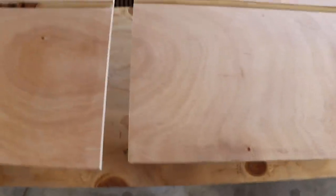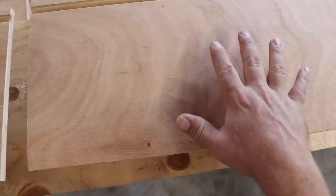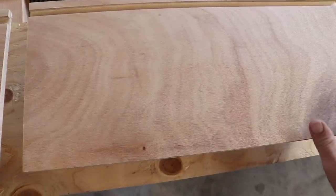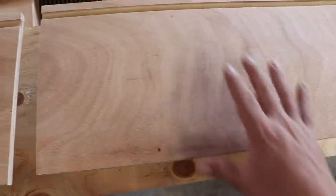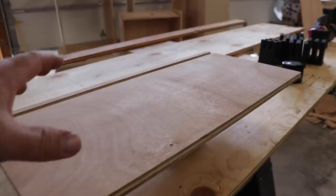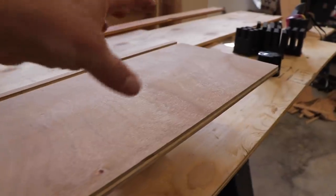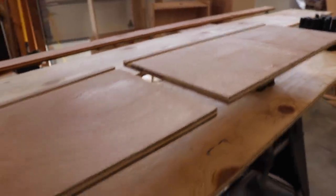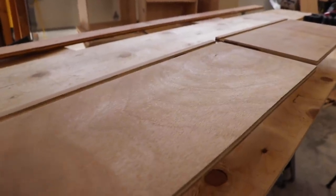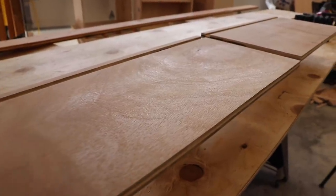So this is super consistent with my experience that the first about three coats or so, they just disappear into the wood. And I feel like that's the sealer part of this whole product. And it's okay, like the wood doesn't really physically look that different than it did when we started. And I think that's to be expected. I expect three coats to basically just vanish. And then you'll start to slowly see kind of shiny spots. And it kind of looks blotchy, which will make you kind of panic at first. But as you add coats, it definitely starts to build and you start to get the gloss that you would expect.